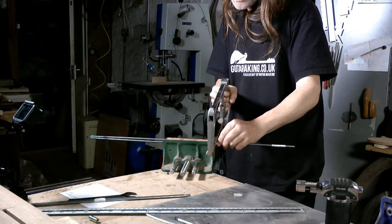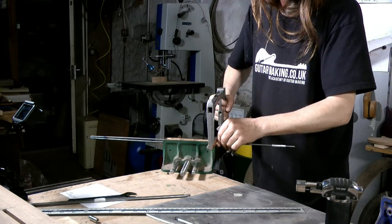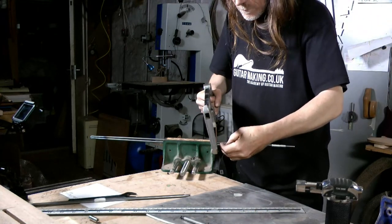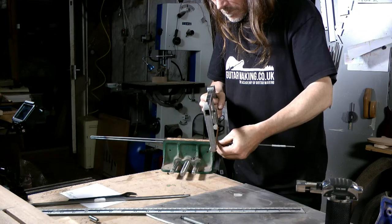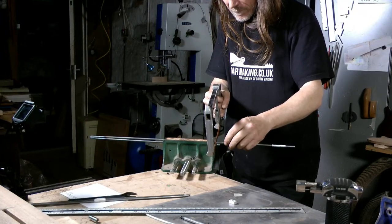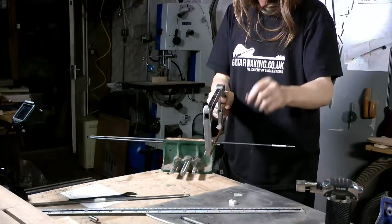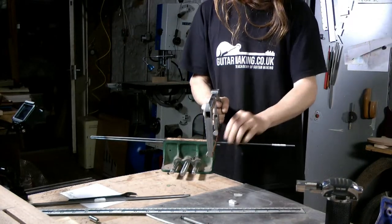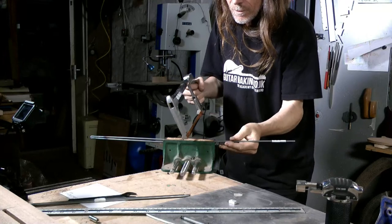Yeah, that's okay. I've lost my little nut. Oh, there it is. Just want to get the rough length on it. About there. As I said, when it's finished, I want to leave about 4 threads poking out. Well, let's say 3 to 5 is ideal. So what I can do is put a piece of scrap under there to protect where I'm cutting through.